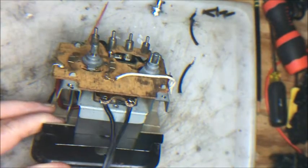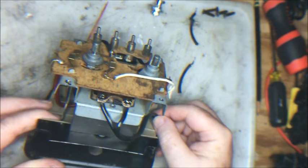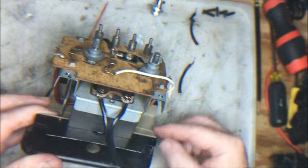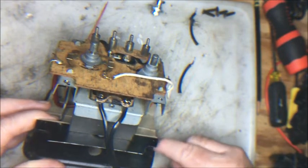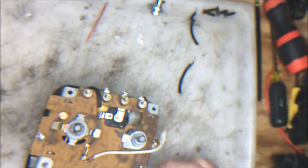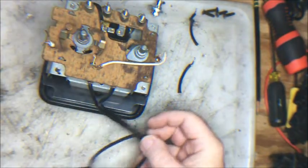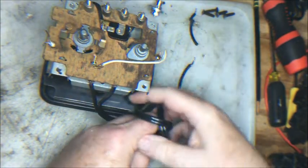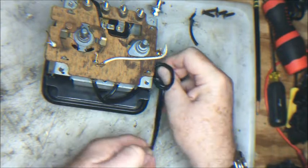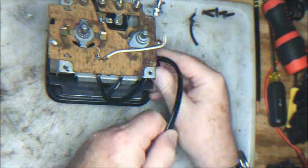Everything is where it's supposed to be. It's important to make a knot at the end of the cord while it's inside the case, because there's going to be a little slot in the outside casing over here on the starboard side of the transformer. So to prevent the cord from ever coming out, we just make one simple little knot in the cord so that it will never pass through the small opening in the casing, and it'll prevent the joint in here from ever being pulled out.